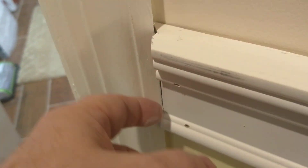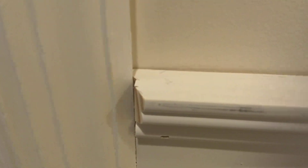I'm really very happy with the way this all came out. I can't wait to put some caulking on here and then paint it. I like how this piece came out too — I was thinking about not doing my relief cut, but no, it's a door casing and getting that cut was hard. I like the way it came out, so I'm glad I put the 30-degree relief in there. I was thinking of just leaving it stick out but it looked kind of stupid — put your relief in there like everything else.